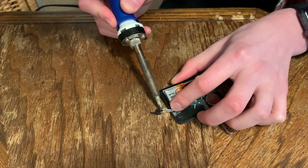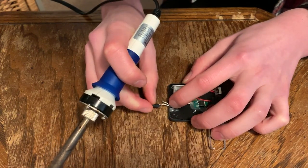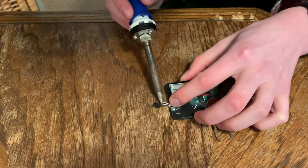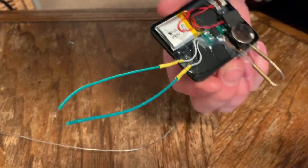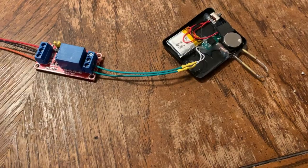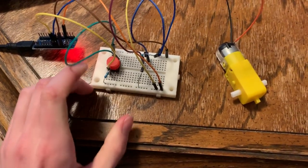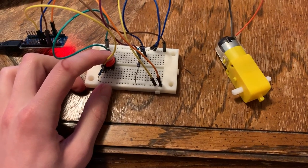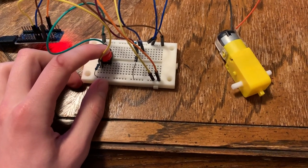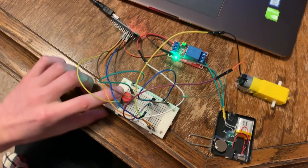I started by disconnecting the activator button from my broken lighter. If you're using the one I have linked in the description, it'll look a little different, but the process is the same. Then I added some extra wire to make these leads a little longer and screwed them in to the normally open connections of the relay board. The wiring for the motor is a little complicated. If you want to see my schematic, you can head over to my instructables page linked in the description.